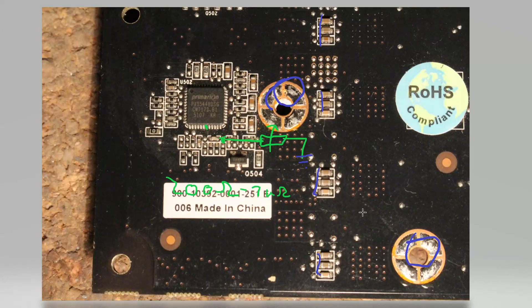For the resistor value I would recommend something between 200 ohms to 1 kilohm. Personally I used 500 ohms — actually I think I used the kilohm — but either works just fine. Even 200 ohms works if you turn it up to maximum resistance; your minimum voltage will just be a bit higher, around 1.25 volts at 200 ohms. It's still perfectly fine if you have a high RPM fan or a custom air cooler like I have on my card.